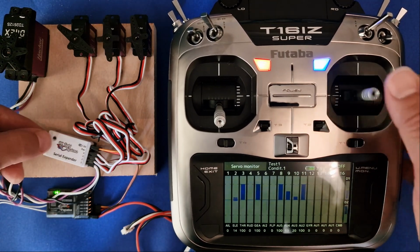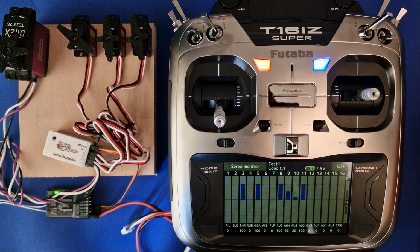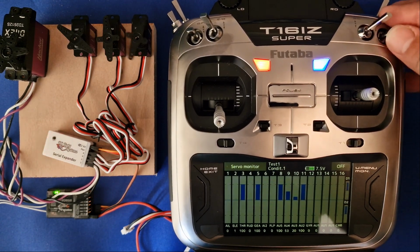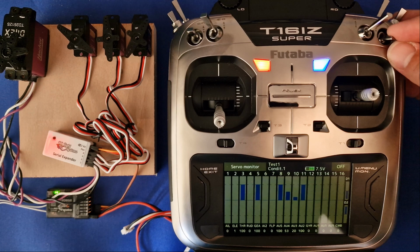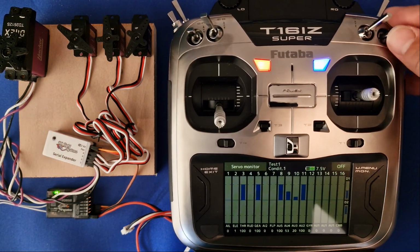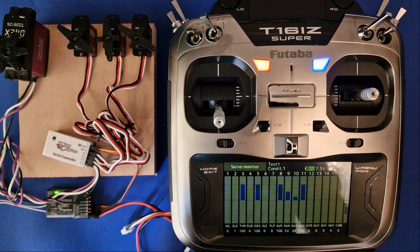And that's done. And we'll now set the 4th channel. There's 4 flashes, so we're doing that 4th one, and we'll set that to this one here. This, if you can see, D1, it's one of the 2 digital outputs on S-Bus, so it's using the D1 channel, so it's only got 2 positions, high or low, on or off, minus 100 plus 100. It's picked that up, so that's now detected all those 4 different combinations.